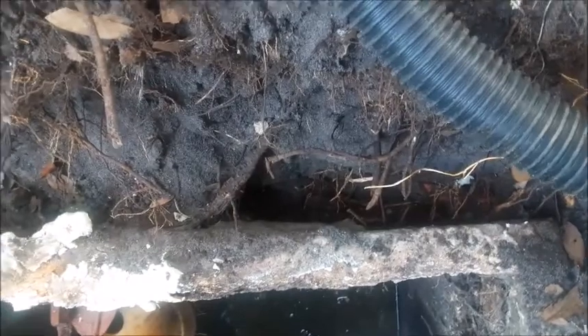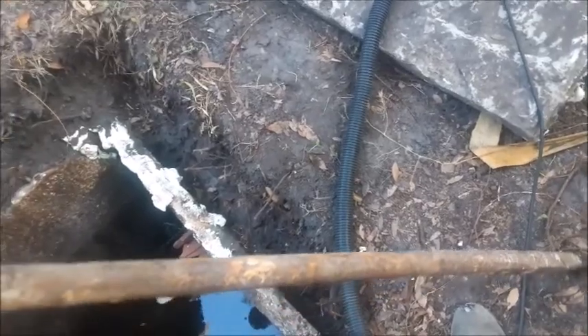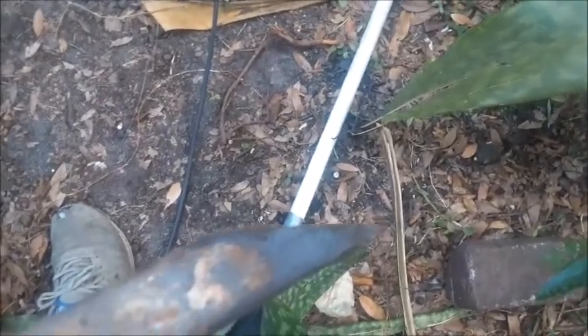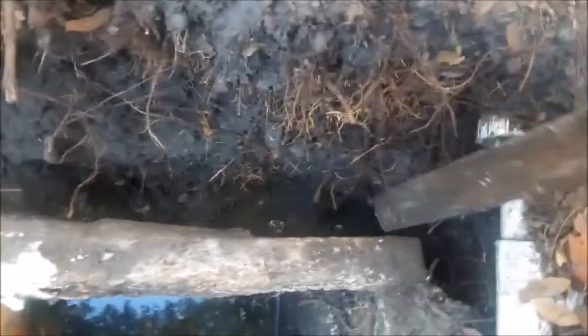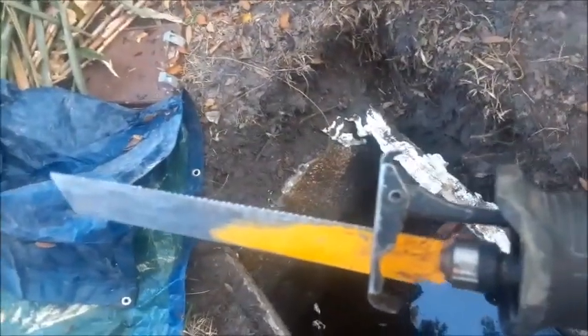Our goal is to make a two to three inch wide trench that goes down below the edge of this crack. Notoriously, septic tanks are going to attract roots, so one of the ways we're going to deal with that is with this tool — it's a solid piece of metal with a wedge tip that we put on the grinder and sharpened up. That metal rod works great for breaking up roots, gravel, and loosening up the dirt. The second thing we have is a sawzall with a 12-inch construction demolition blade.